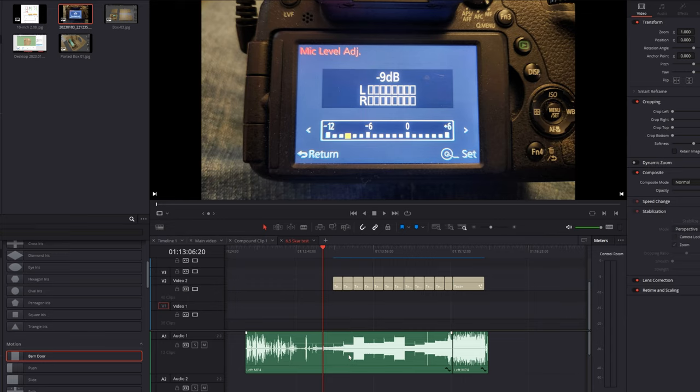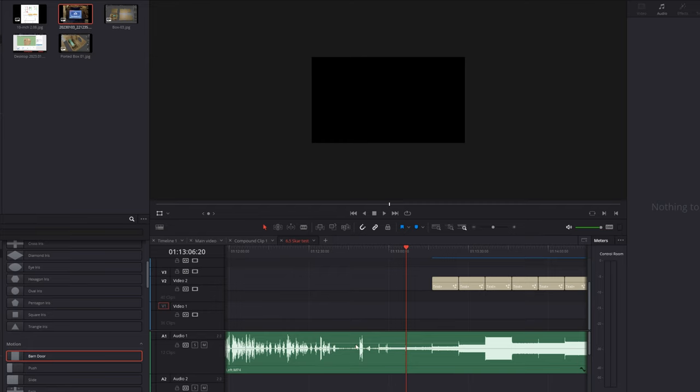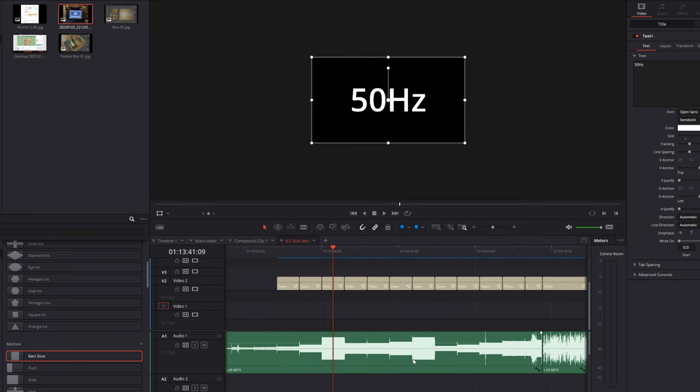So what's interesting, this is what came out from that clip. This is the sound file. And if you look, of course, it was going in 10 hertz increments, so it's kind of doing a step deal. But from right here, this is 30, and you can see right around 30 is when the volume gets louder. So you can kind of get an idea of what frequency it has the most dB. You're not going to get exact dB, but you can get a good idea by just doing this frequency test and seeing what volumes it plays louder.